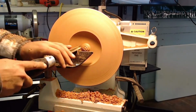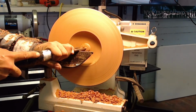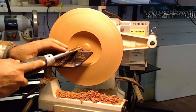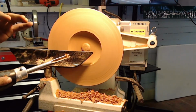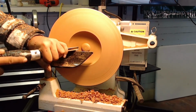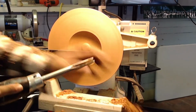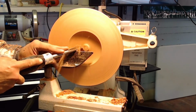When I get to that much material right there, you don't go all the way through it. You stop, you plant the tool, or some people say anchor. I say plant it on the tool rest for the sake of pivoting. The word anchor I don't like because it connotes the idea that you're just keeping the tool right here, and you're just maybe doing this. But you want to plant the tool to then be able to pivot. Okay, that's the whole point.